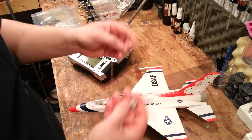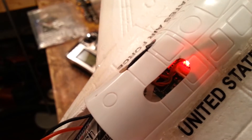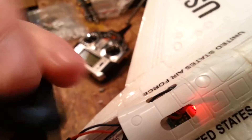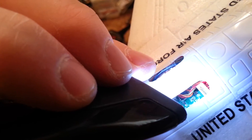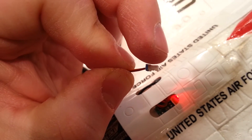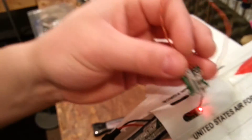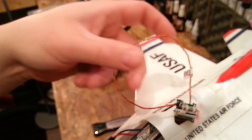I got a little linear long throw servo and I'm just going to get this lined up and get my polarity right. The only way to tell which way it plugs in is to look closely — there's a little rail that's closer to one side versus the other. If you look at the plug, that rail on the side lines up more with one side than the other. So I'm just going to plug it in. Now don't worry if you're on the wrong side — it won't hurt it, it's just not going to work. You can see how it moved to one side, so there's something happening in terms of activity.